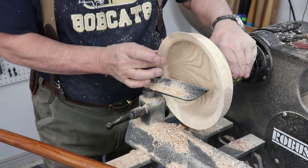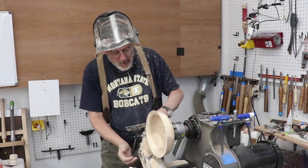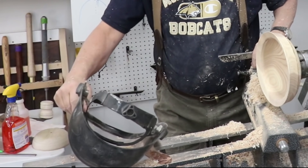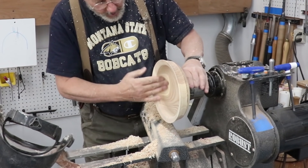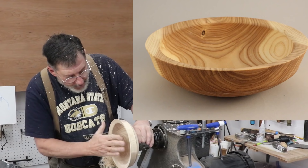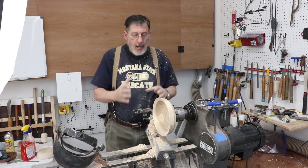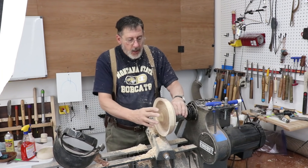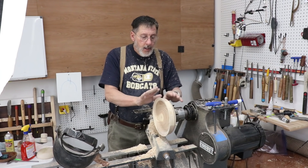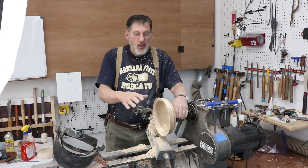I'll do a little bit of work off camera — I'm still a little bit thick, especially right here. I'm going to take a second and review where we're at. I spent a little bit of time off camera fine tuning this surface and I'm very happy with that. What I'm going to do right now is sand. My procedure at this point is to do the finish sanding and apply one, two, or three coats of an oil on a salad bowl like this. I'll do that off camera — save you from watching that. I have a little bit of an undercut right here that I'm happy with — it gives you a nice place to pick the bowl up. It's going to be a nice salad server.